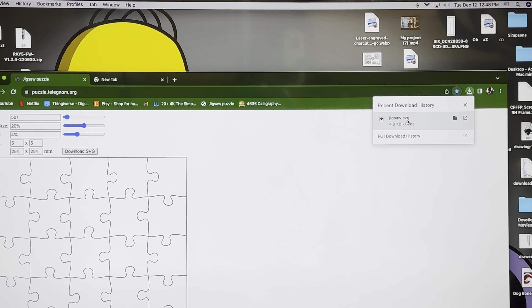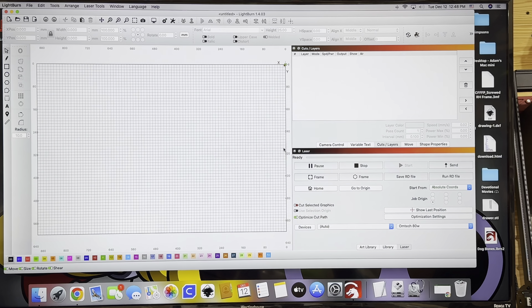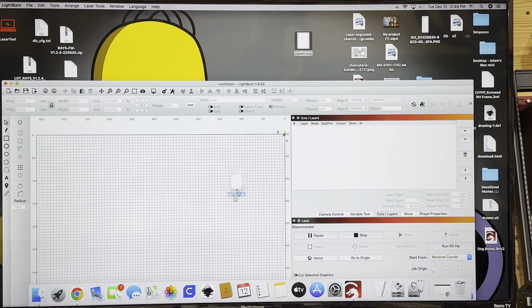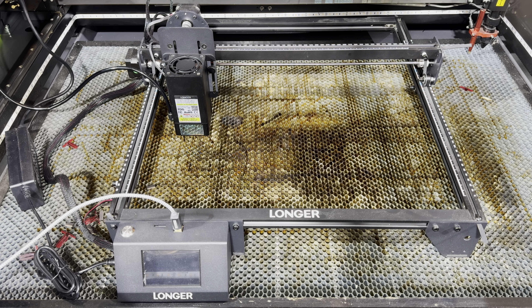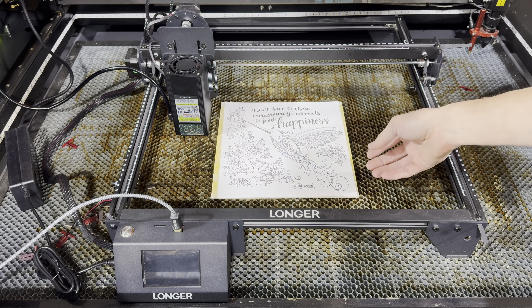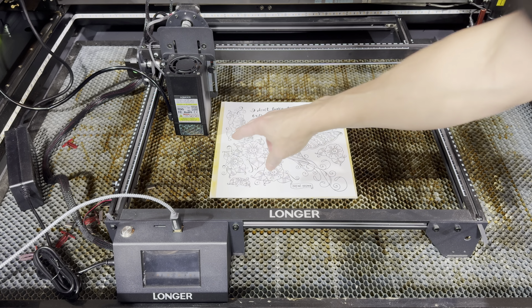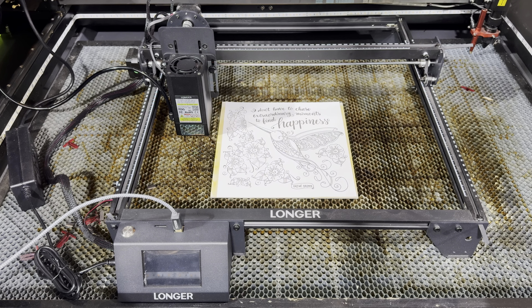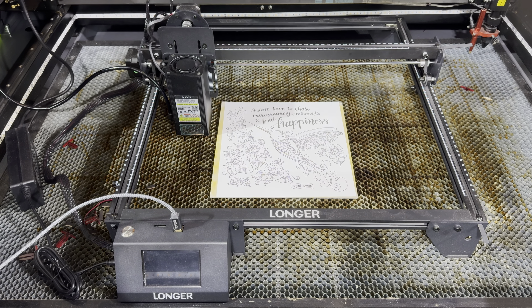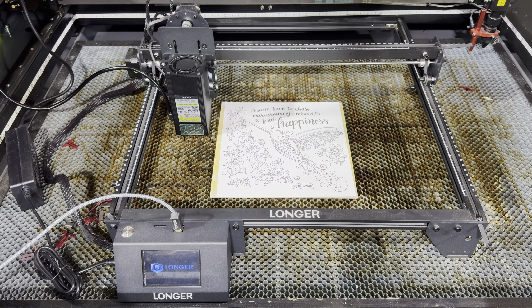Let's go ahead and open Lightburn. Here in Lightburn, we're going to grab our file — I'm just going to take it from the desktop and drag it straight into Lightburn. It is already set up for a line cut. After that, we're going to go ahead and place our piece of glued wood into the laser, make sure it's going to lay flat, and once you've made sure to set your focal distance using that little square acrylic block that came with your laser, go ahead and power your machine on, then go back over to Lightburn and frame this out.